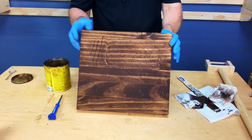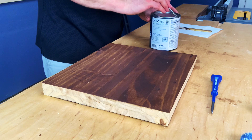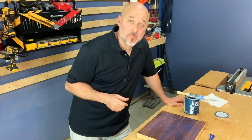We're going to put a water-based polyurethane — three coats — on this and really make it pop. This is going to be a really cool piece. I'm going to use this Behr brand from Home Depot. I really like it; it is giving me excellent results. I'll leave links in the description for all the products I use. I'm going to let this first coat dry, come back and do two more coats, and show you the final product.